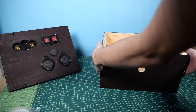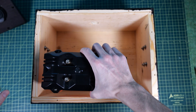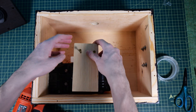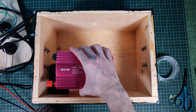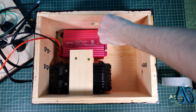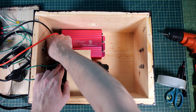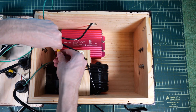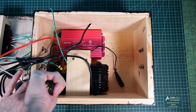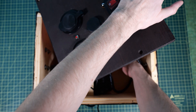With the front panel done, it's time to install everything into the box, starting with the battery. I cut some strips of alien tape and place them on the bottom to act as a cushion insulator and help stick it in place, and I put a little on the top mount as well. With the battery in place, I install the inverter — alien tape on the bottom, stuck down where I want it, and also screwed it into the baseboard. I attached the LED light to the terminals on the inverter so it powers on with it. I then wire up the battery — attaching the charge controller, the inverter, and a terminal for the wall charger on each positive and negative side. Finally I plug in the extension cords and the USB cords.